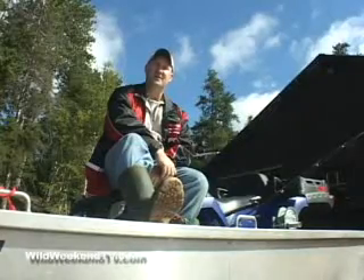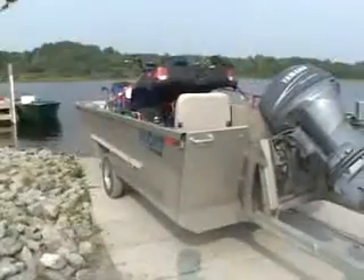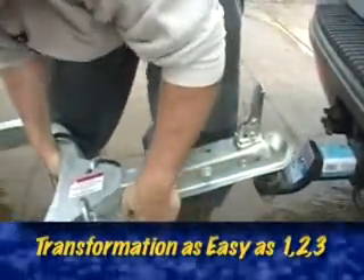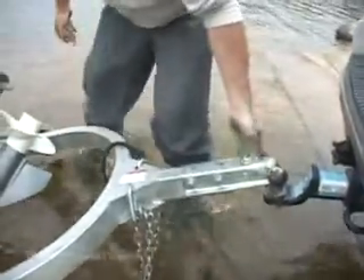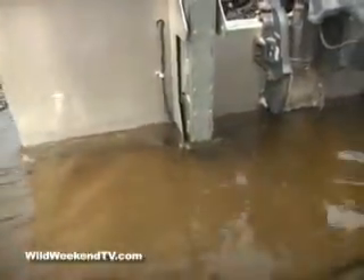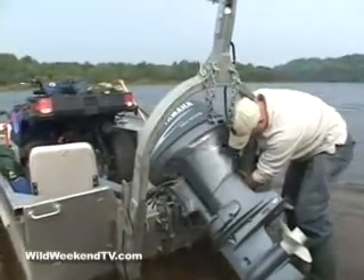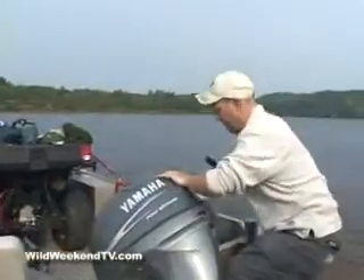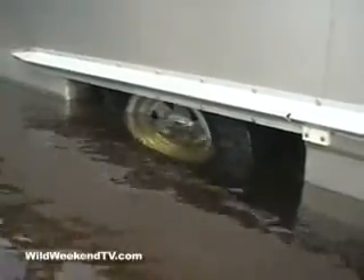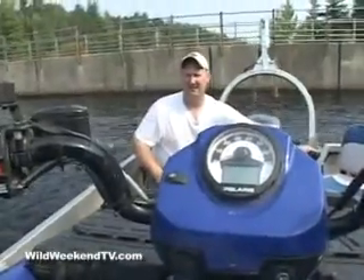You can actually get it in and out of the water faster than what you can in a normal boat. Not only incredibly cool, but simple to operate. If you're using it as a trailer and you're getting ready to launch it as a boat, just before you back it into the water, you take your trailering pins out, you back it into the water just to the point where the back of your boat is about a foot into the water. It only takes about five or six inches to float. At that point, you release the pressure on the hydraulics in your transom after you've taken your pins out of the trailer hitch. You climb into the boat, winch your wheels up. The crank is really easy. Close the doors that house the wheels and you're ready to go. Simple as that.